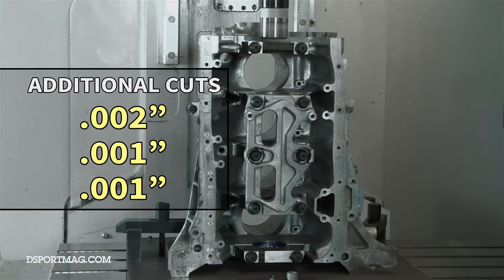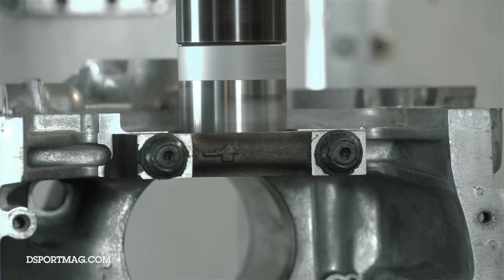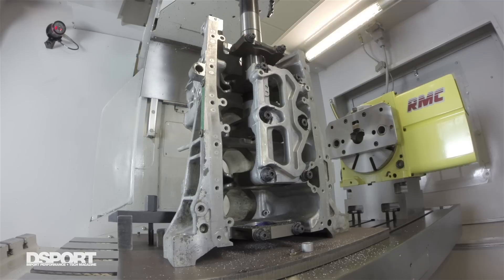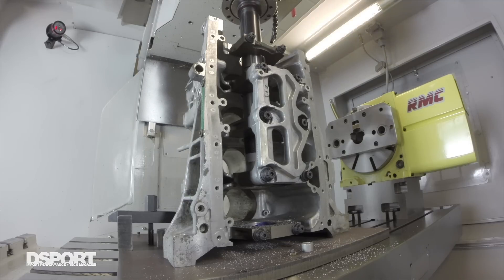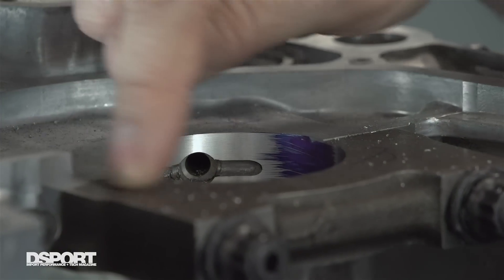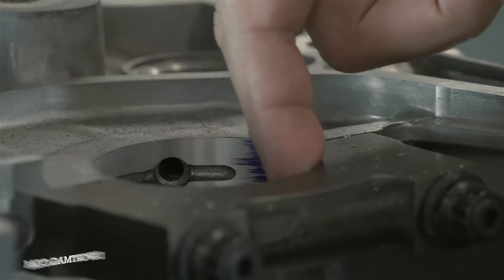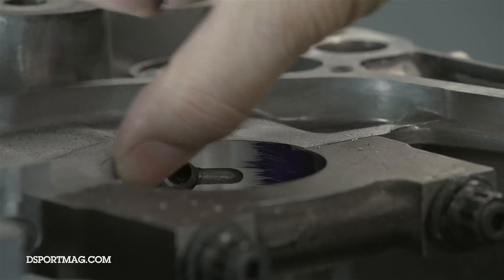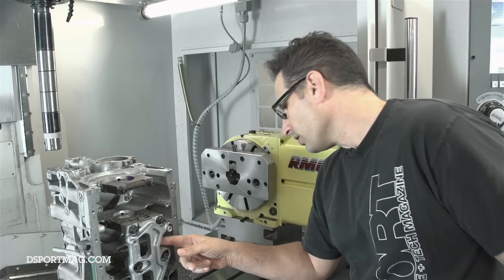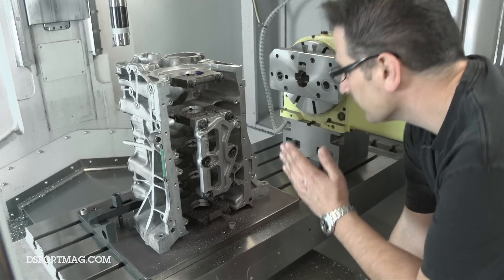Compared to the first cut, you can hear a bit more material coming out, meaning the contact patch is growing. You're mainly going to see that on the cap side instead of the block side if you're set up right. Just about that much that hasn't been touched yet. You can see the extraordinary finish that we're putting on here — better than the factory original finish — so that is one nice plus, being able to control that. We've got about maybe a thousandth left in it, and we're just double checking the setup tool now. You can look at all of them and see that it's cutting exactly the same.